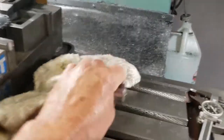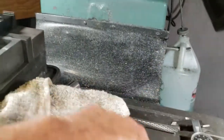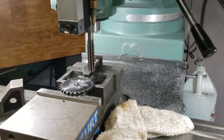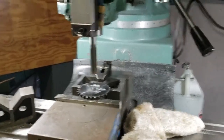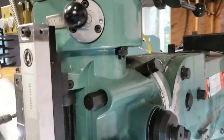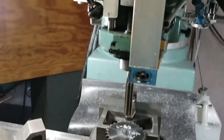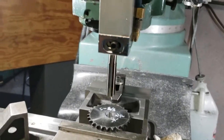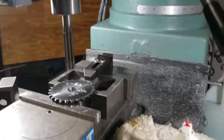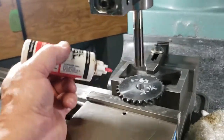The reamer fell into the slot. I'm going to put the reamer in and ream the hole. I put the reamer in and set a repeat to go back and forth. I'm going to put this in low gear because I don't want to burn up my reamer. It feels about right. I need cutting oil — I've even used WD-40 for reaming, but this is actually better.